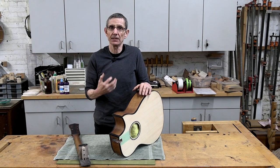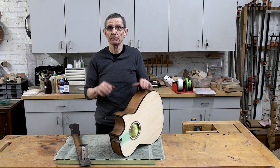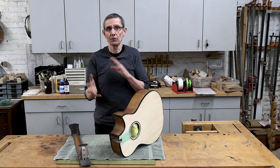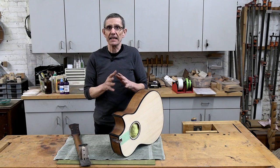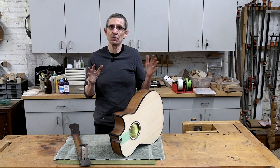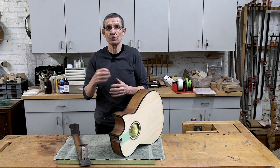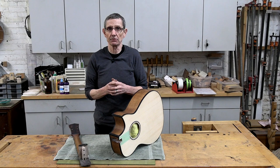Because in my opinion, buffing, whether you do it by hand or with a pedestal buffer, is one of the trickiest things to learn to do and to learn to do well. It also does require a little bit of an investment in materials. The other problem with buffing is there is a lot of information about different ways of doing it. For example, I've heard of people going from P800 right to a buffing wheel using a very coarse compound and then working up to the very fine compounds.